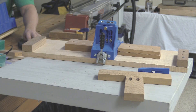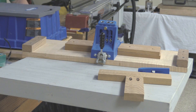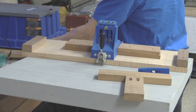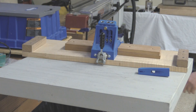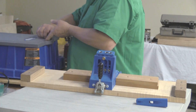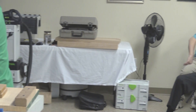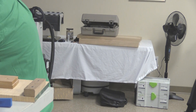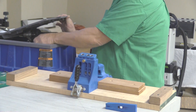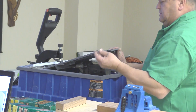Once you're satisfied that the joint is where you want it to be and there aren't going to be any adjustments, you can glue it and put it back together. Having built a number of pieces of furniture using this concept, it is not especially tolerant of multiple removals of that screw, so you want to plan ahead. They are special screws, and for exterior furniture they actually have stainless steel screws, but they're expensive.